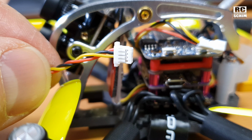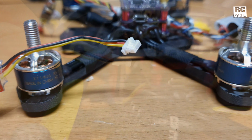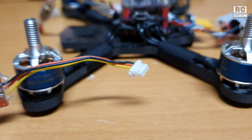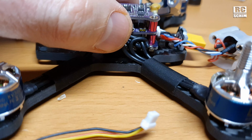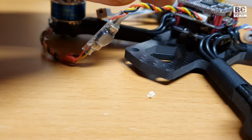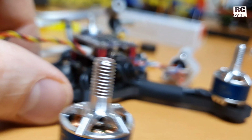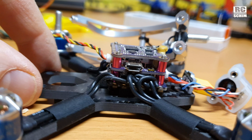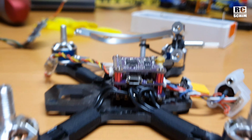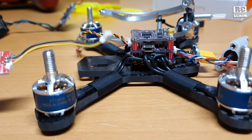It totally did fit there because it's the same dimensions. This is the connector the Runcam Hybrid should have to be totally plug and play swappable. This is the cable for the radio receiver, which appears to be the same cable as the video transmitter. The way they stacked this is very clever. The single boards stack to each other with a connector. It's tight, but it's accessible and very nicely repairable actually. You're not getting a hard time disassembling this to the stage where you can access those cables and change them to your own receiver, for example.